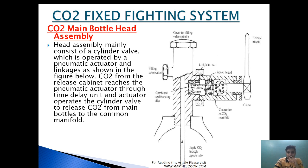As the seal is punctured, the liquid CO2 from the bottle will come out and go to the CO2 manifold. To prevent unwanted activation, a pin is provided which is placed to prevent operation of the release handle when the CO2 bottle is transported or shifted — for example during survey or filling time. A filling connection is also provided here for refilling the CO2 bottle if the amount has been reduced or is not up to the mark.